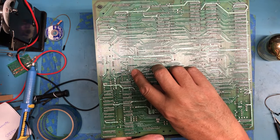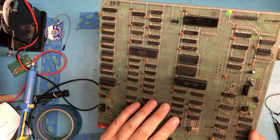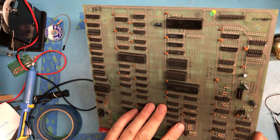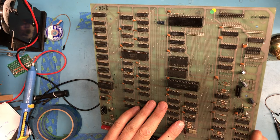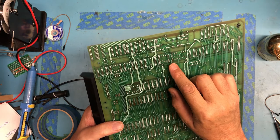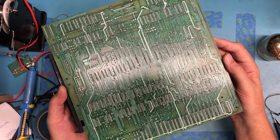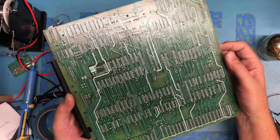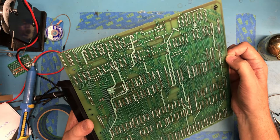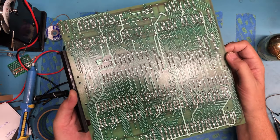This part has been replaced, most likely - looking at the flux on the board and the solder. I believe it's an opto-isolator - the part number is H11G3, maybe, or GE017. Being a 6-pin DIP, it's almost always an opto-isolator, so there's been some rework there. It's been repaired at least once - or possibly in the factory that part was replaced. There's definitely enough flux and shinier solder than the wave soldering left for that part.